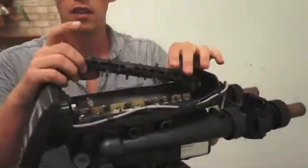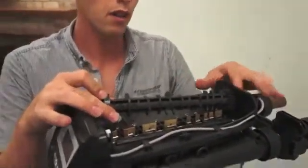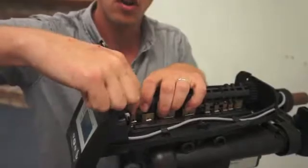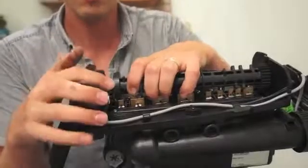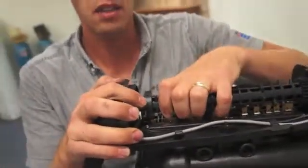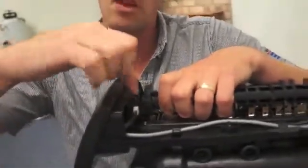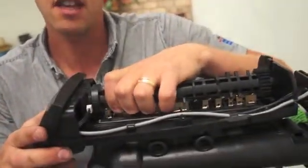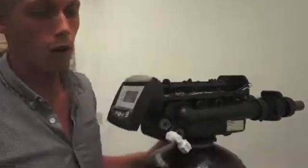What you do, identify the arrow in the front again. Go ahead and slide the rear of the cam into the hole. Make sure that your optical sensor is in place. Hold your cam all the way to the back with the arrow in the up position. Push against your discs. Line the front of the cam up with your optical sensor. It's going to go right in between the U shape of that optical sensor, and it's going to slide forward right into place. Very simple, very easy. One of the keys, again, is lining up the arrow.